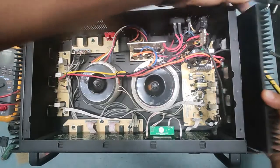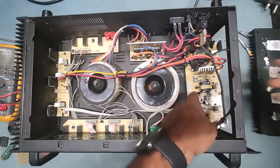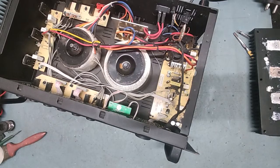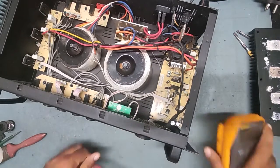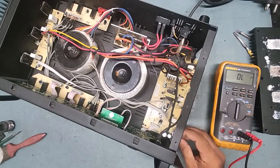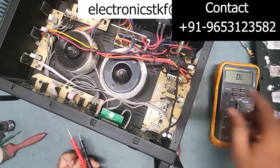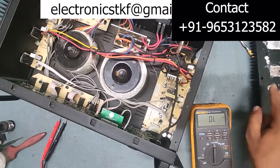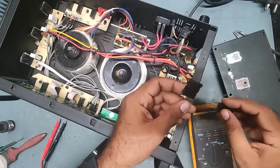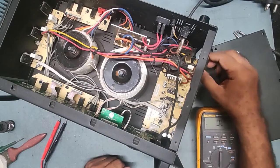I have already removed everything. Here is the fixing body and the PCB. We'll turn this one over. We'll check the condition of the existing transistor — if it is good or not. This is an NPN transistor, so we'll remove it and check. We also need to fix two more transistors. All three are the same number — NPN C5200. This is a very common transistor available in the market. We'll take out this transistor and check it separately.